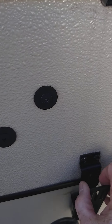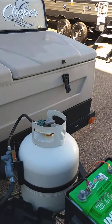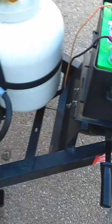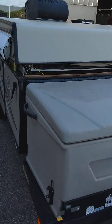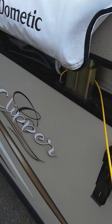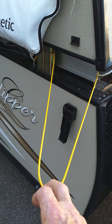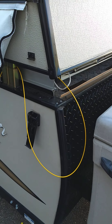So there are four latches — we undid two of them, let's get the other two. We'll come over here to the crank. This is the labor-intensive part here — let me get the lid out of the way for the battery. So it's going to be cranked up like that. I'll take a break, and then when I come back this will be up. Basically you're going to take it up until this line is taut — this line right here is taut. This line is set so when the roof is up and this is taut, it's in the correct position to insert the screen door in there. So you want it to be taut so the screen door will fit correctly. I'll continue in part two.